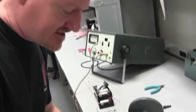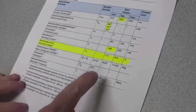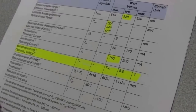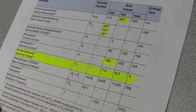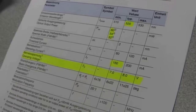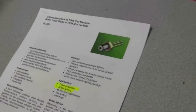The second thing is the operating voltage: seven to eight volts, and it really does that. The typical operating voltage we're seeing here at 160 milliamps is indeed seven volts, and it gives you somewhere between 50 and 60 milliwatts out of the single green laser diode. The last thing — it's not shown on the data sheet, but we determined it here on our curve tracer — the dynamic impedance of this laser diode is 10 ohms.